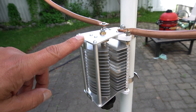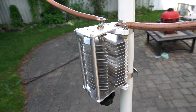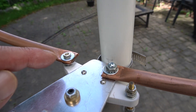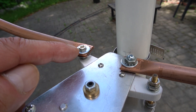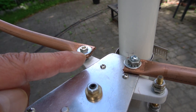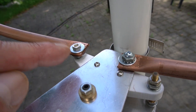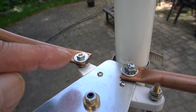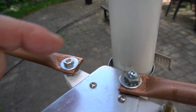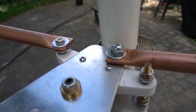Down here we have the air capacitor, 15 to 240 picofarads. As you can see it's quite large — the blades and all that. The connections I made here: I used a vise to press the end of the copper tubing flat. You can do it with a hammer but it doesn't turn out as nice. I did my first ones with a hammer — on my Moxon antenna I hammered to smash the copper tube but it didn't turn out quite well. This time I used a vise and it did a really good job. Then I just put a hole through the tubing and put a bolt and nut there.